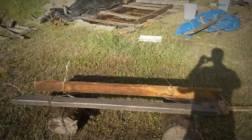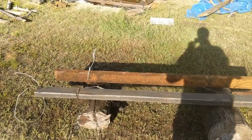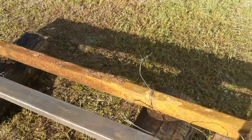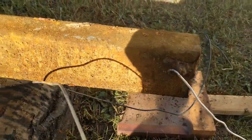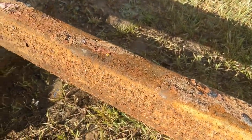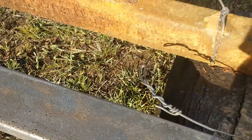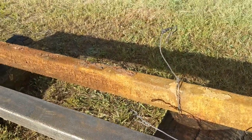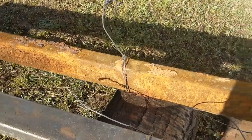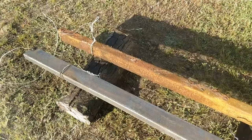Here's a quick in-progress update. It's Thursday — I've been running it since Sunday. Every other day I have to take the sacrificial metal out to clean it. This was brand new steel when I started and it just attracts the rust and gets eaten up too. The one I've already cleaned is pitted. I just hose it down with a wire brush to get the big stuff off, then use a wire wheel on an angle grinder to clean the rest. Then I hook it all back up and after 48 hours I do it again.